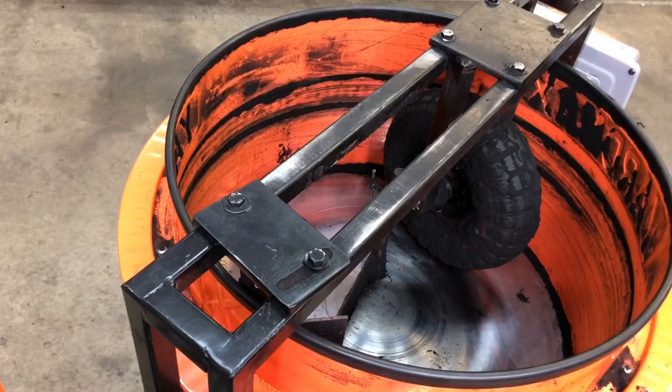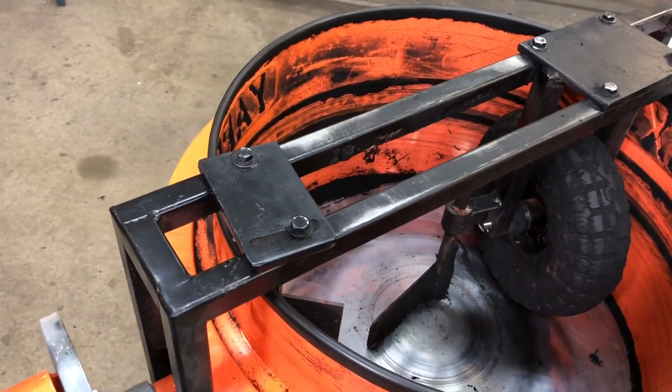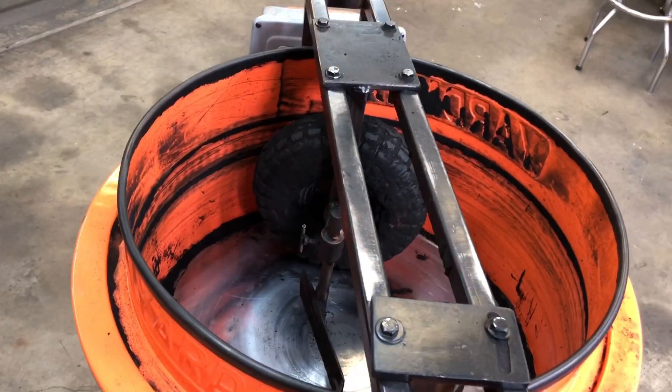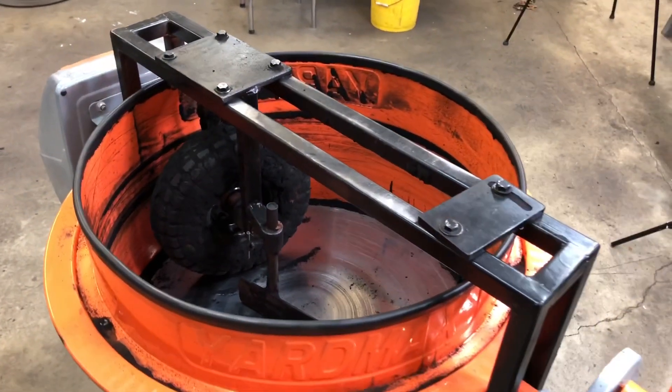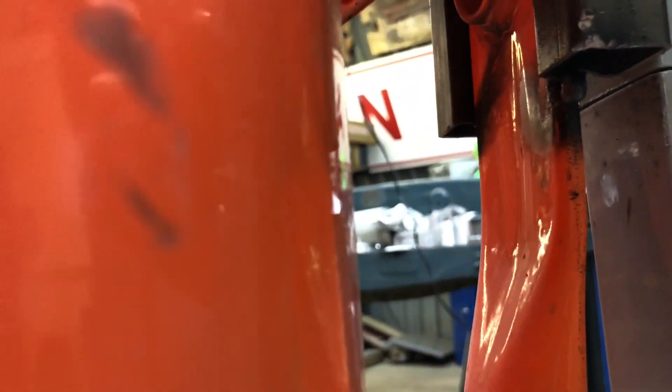Next would be this upper framework. I could go into cutting and welding and grinding, but I think if you're building this sand muller, you or your buddy or whoever is helping you can do this on your own — it's just simple measuring. One inch tubing. It's just welded in place. You can see a tack weld right there. I just slid it down over once I got it where I liked it and tacked it. I didn't weld it hard because I thought maybe I'd have to take it apart and adjust, but I did not.